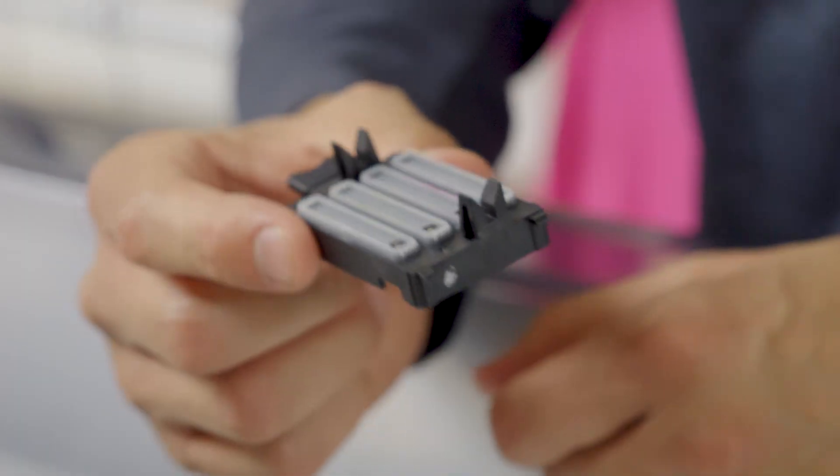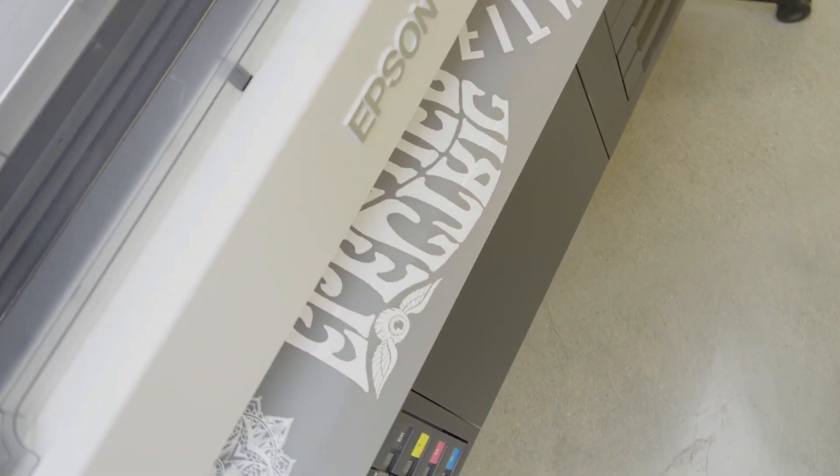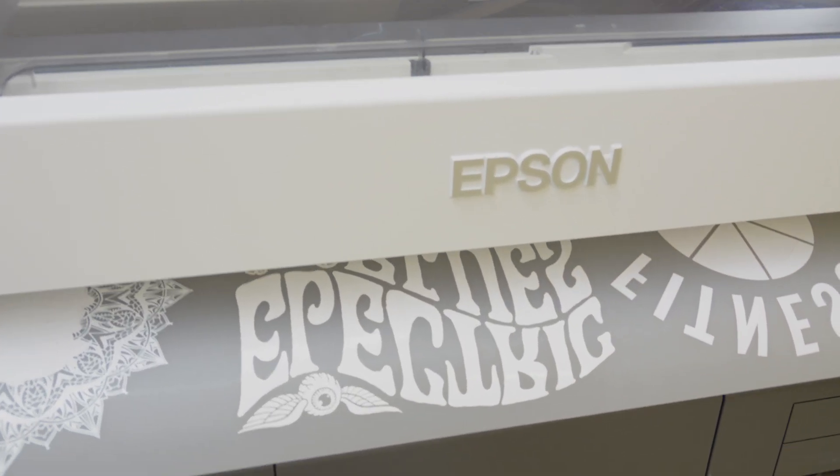Wow, that's a game-changer. Is there any weekly and monthly maintenance required? Generally you want to clean your suction cap about once a week and wipe around your print head about once per month — otherwise the auto-maintenance features keep everything primed and clean. One of the big complaints about direct-to-film has been the amount of daily, weekly, and monthly maintenance, and hearing that you've not only solved but conquered that whole issue is pretty awesome. At Epson we take user feedback very seriously and design products to specifically address those pain points.